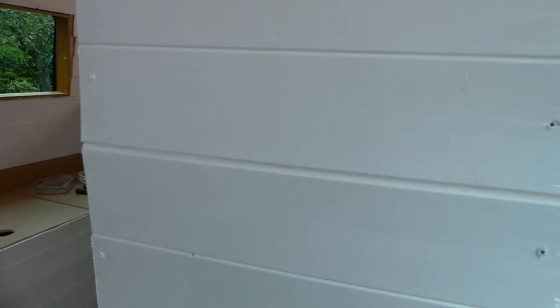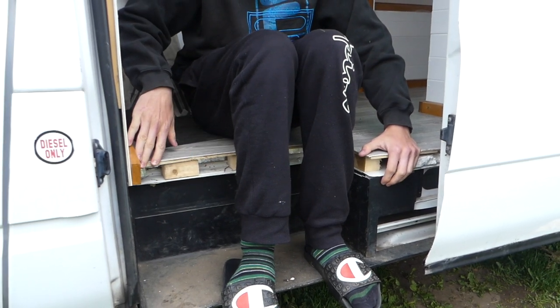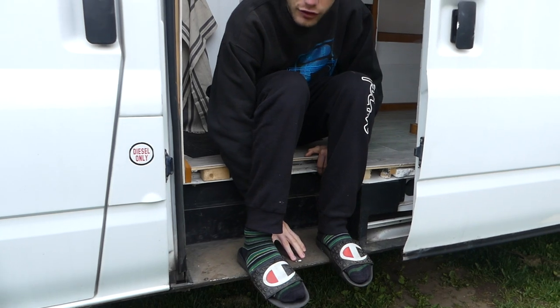We painted one coat of fast-drying Leyland brilliant white paint onto all of the cladding. It's Thursday now — unfortunately our camera died as we were doing the repainting, but as you can see we used Poundland wood filler on all the cracks and went over it with brilliant white Leyland paint. It looks clean and fresh again. Today our plan is to fix up the step area as you come into the van — we're going to put some 18 by 44 millimeter timber struts as trim, similar to what we've used on the walls, and maybe get a rug from Poundland for the doorway.